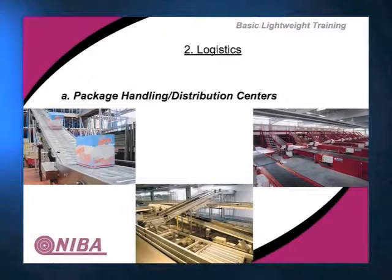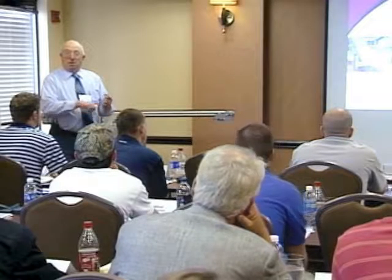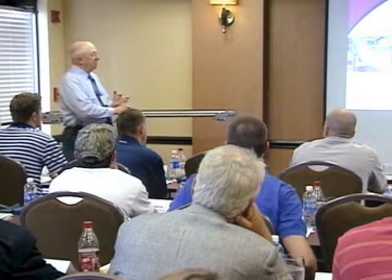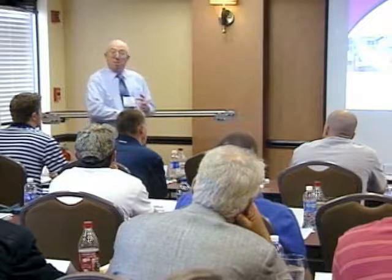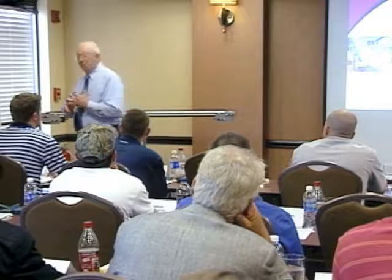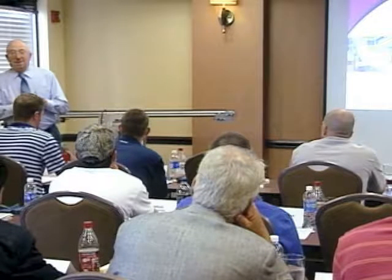Distribution centers. Tom pointed out last night at dinner that we didn't spend a whole lot of time talking about solid woven belt — solid woven PVC styles. And yet in these applications, as well as a couple of others, there are miles and miles of this: 90 pound, 120 pound, 150 pound. Cover one side, cover both sides in some cases. Friction-friction, and friction by bare. Bare is the straight fiber with no impregnation to seal it up — almost like a brushed back — and it reduces drag.